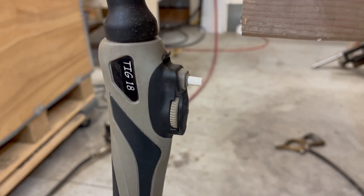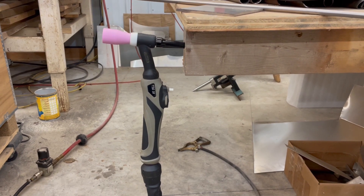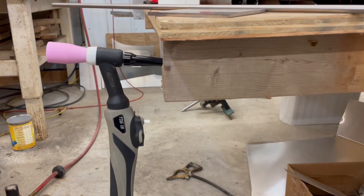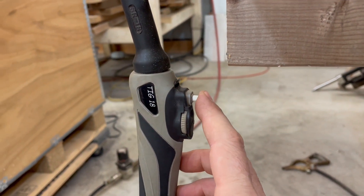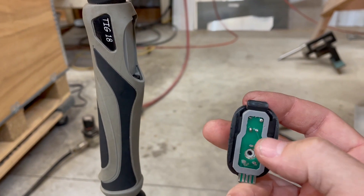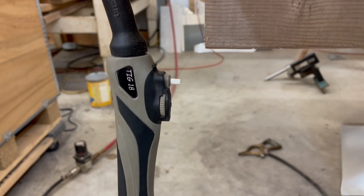The reason I do that is most of the welding I do is almost all free-handed. I don't have the luxury of sitting at a workbench and hitting a pedal — most of this stuff is up underneath a piece of farm equipment or a vehicle, or some weird position where you can't even reach a pedal. So I've grown up with hand control and that's what I've learned to use. This little on/off switch — that little white part — is actually the top of an ink pen. I've disassembled the entire piece, that little circuit board in there, and soldered in a different micro switch: replaced the momentary switch with a latching switch, so it's just on, and you click again to turn it off. For what I do, it works really well.